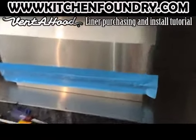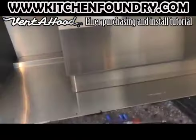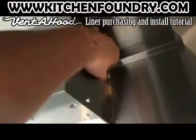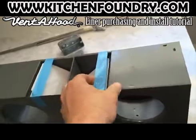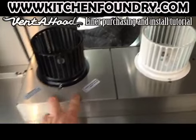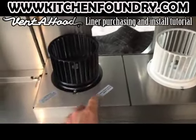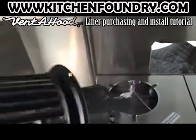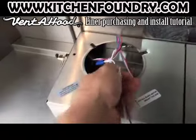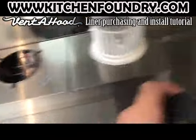Here I'm just removing this blue shipping tape. You're going to notice it's securing this Easy Clean heat shield to this blower housing. Furthermore, we'll find some more blue tape holding these gravity opening dampers down. You'll want to remove this tape. Here you'll identify a sticker that has you removing this black motor. As I mentioned, this product has a junction box built within itself, and so we need to attach a strain relief and do our final electrical connection behind this black motor.